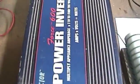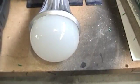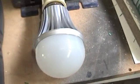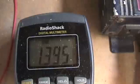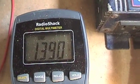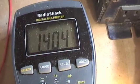This is a typical 12-volt to 110-volt inverter. I wanted to show you the power draw with just one of these LED bulbs — I'll screw it in. We are at 1.4 amps to light that 7.5-watt bulb. Just as a comparison, you can see that is a whole lot more power than the DC converter approach.